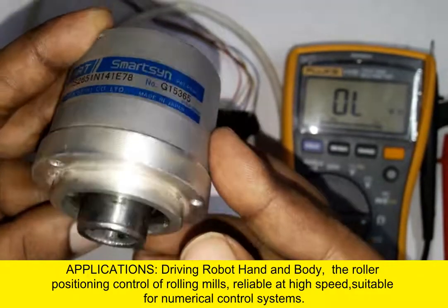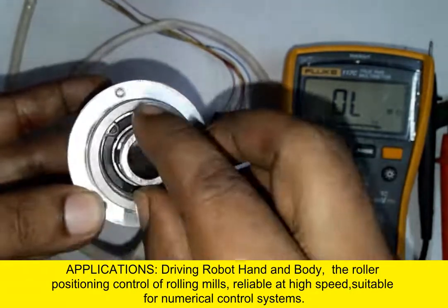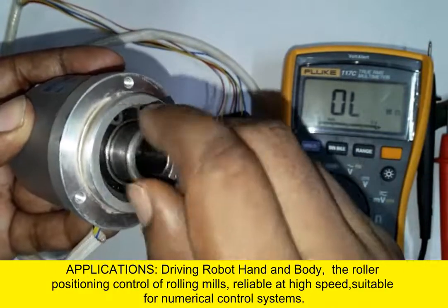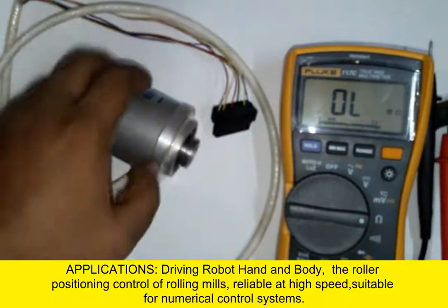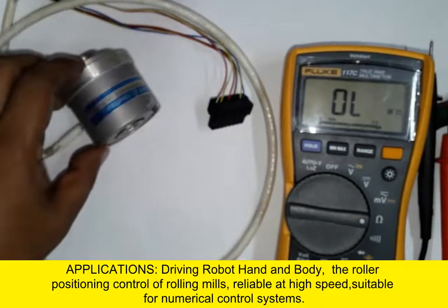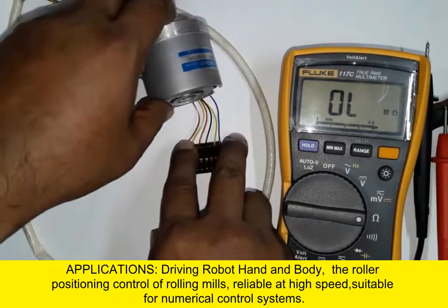It has two parts — primary and secondary. As a troubleshooter, you need to check that the bearing is rotating smoothly, and also test the primary and secondary units. If both show good readings, then you can use this resolver in your application.